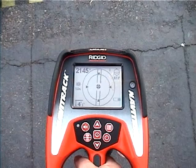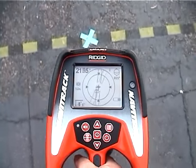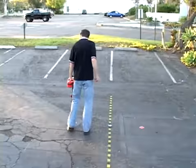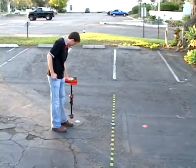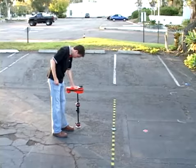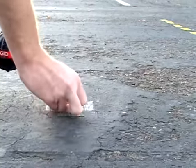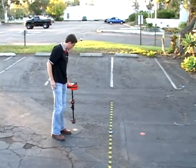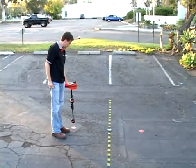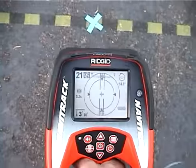The equator lies between the two poles, and we'll pass over it on our way to the second pole. We'll find the second pole and mark its position. At this point, we've localized the sonde to a position that is somewhere between the two poles and directly in line with them. To pinpoint its position, we'll line the receiver up between the poles and head back to the equator.